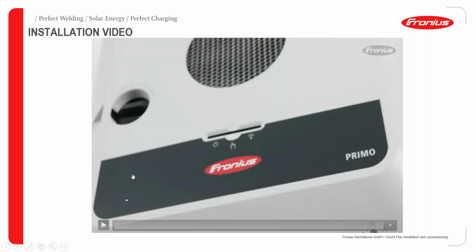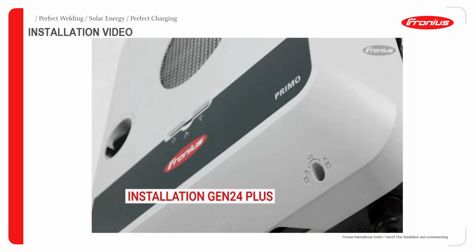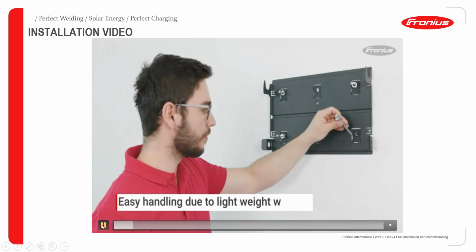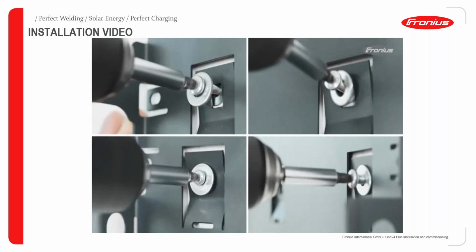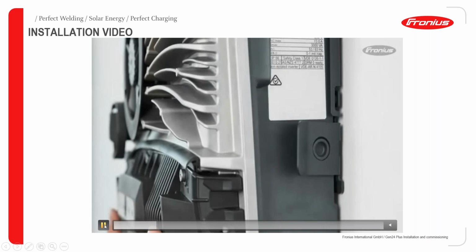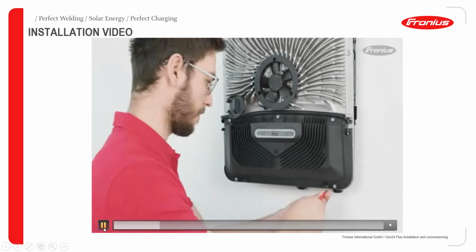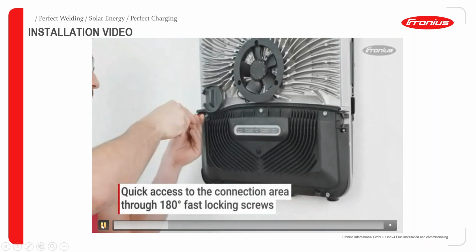So, like I said, I was going to see if I can play a video to describe everything that I have been saying so far. As you can see, this is just a short video about the process of installation. As earlier said, installation of the wall mount bracket. Then after that, you snap in the inverter. In this case, as you can see, the circular groove indicated here, you can not just hear the click, you can also observe it to be sure that the inverter is firmly in place. Then afterwards, we can screw down the 5 180 fast lock screws.